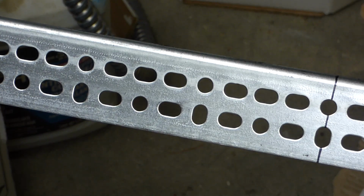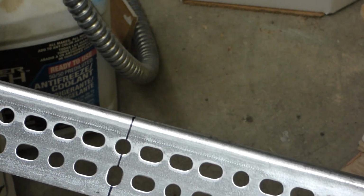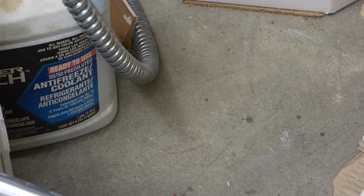And a cutting we will do. The way I'm cutting this is I'm doing it so the middle part here is down on my surface. That's going to keep it from flopping around, rolling around. And also I'm going to get basically two cuts in, both legs, by doing this. And you just saw away. So if your saw isn't really cutting good, it might be time to replace the blade. This one here is still pretty sharp, but to save film, I'll cut this back.